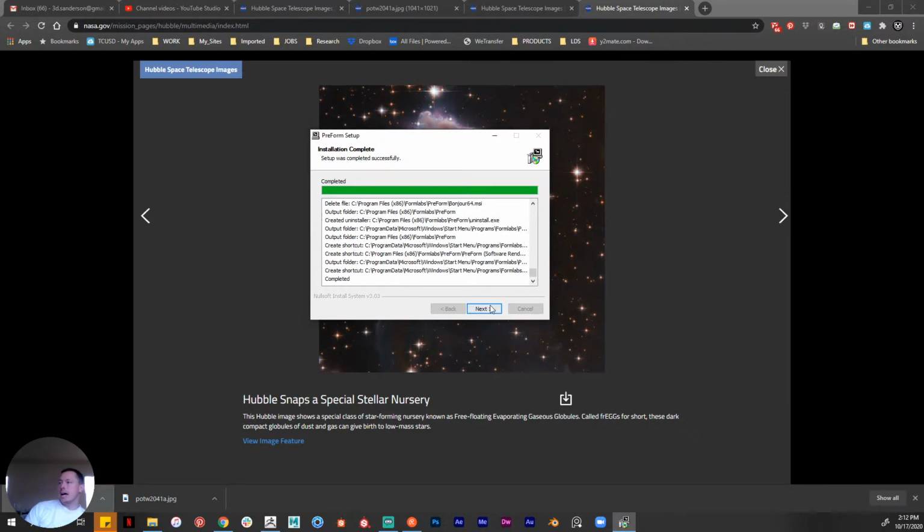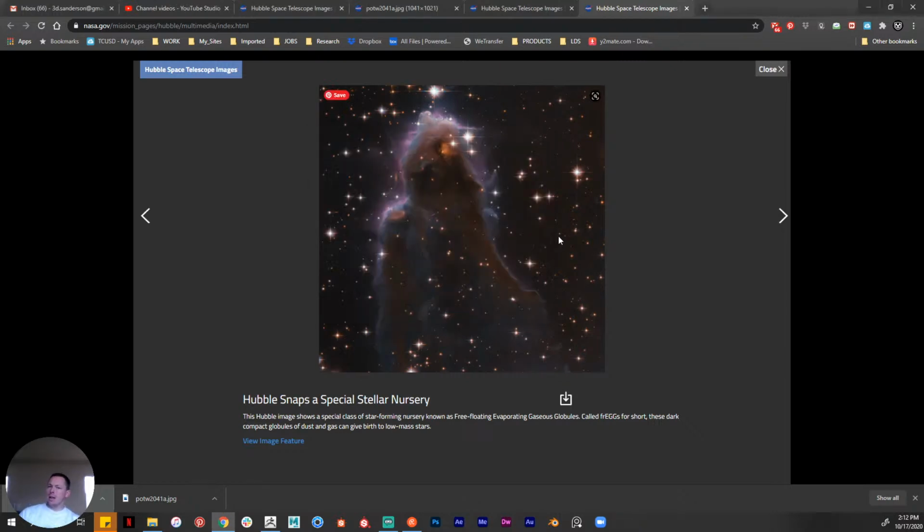One thing that I would point out and that I want to add to, I might go through and redo the mold making techniques series, because there are two things that I neglected to think about when I created this tutorial, and that I would encourage you to be mindful of when you apply it yourself. When you 3D print a mold, or when you create a mold, like a mold box, you want to make sure that you consider things like draft angles and pour spouts. I totally neglected to even think about draft angles and pour spouts, and it really negatively impacted my ability to keep my pieces together